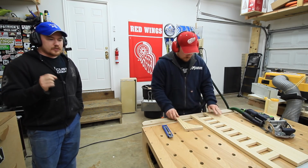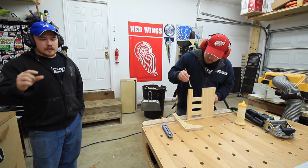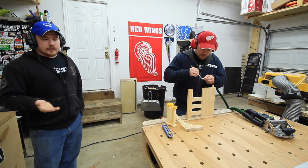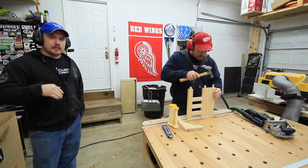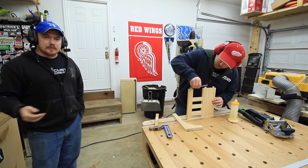The only place where you couldn't use a pocket hole is where the side panels or the side pieces on the front side where they attach to the top shelf, which that's okay anyway because in this case I'm just going to pre-drill from above and use a screw and then plug that hole, paint over it. You'll never see it. It's all going to be the same anyway.